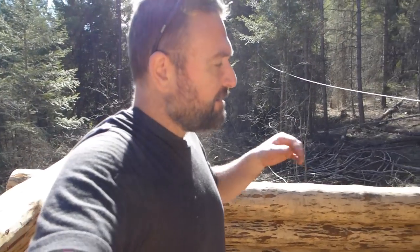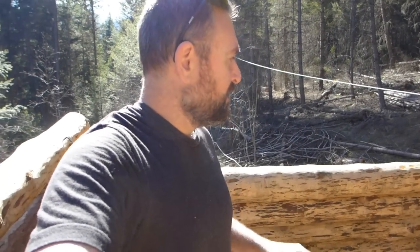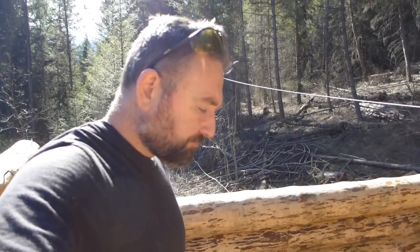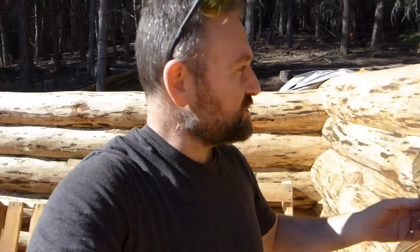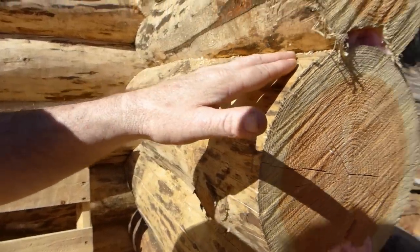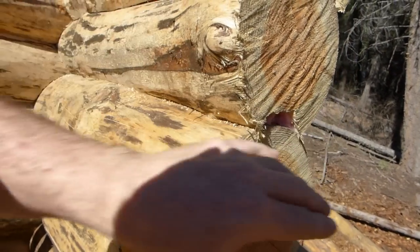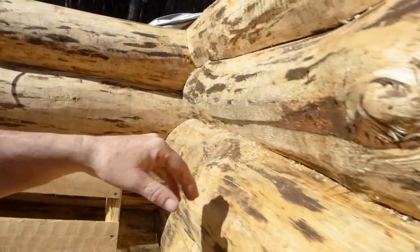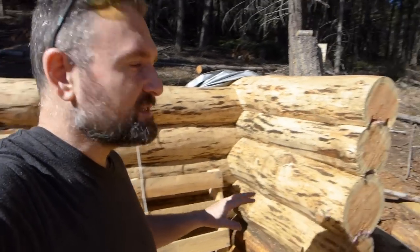I've got the insulation in there, it's down. And just to answer a question that I've had several times now, people have asked me why am I insulating the inside of this log? What's the purpose? Log cabins are supposed to be, the wood's an insulator in itself, they should be warm. Well, that insulation in there is not really to keep the cabin insulated in the true sense of how this roof insulation works. It's really there to prevent airflow or wind or drafts from blowing on the outside of the cabin and making their way in here. If this was just an empty void, that airflow could get through here and we could get little drafts. If the cabin's not too tight, those drafts could make their way through. So that's why the insulation is in there.